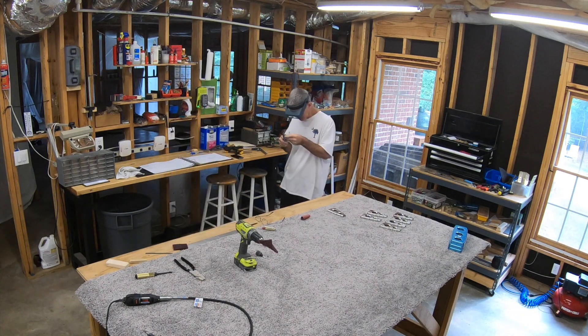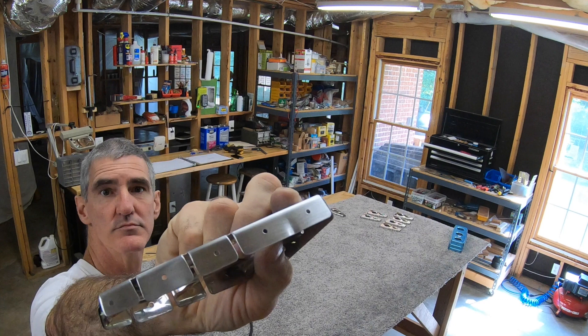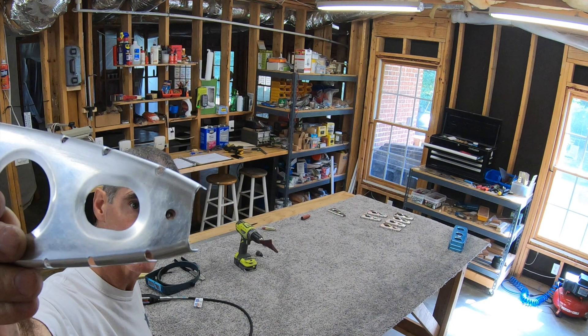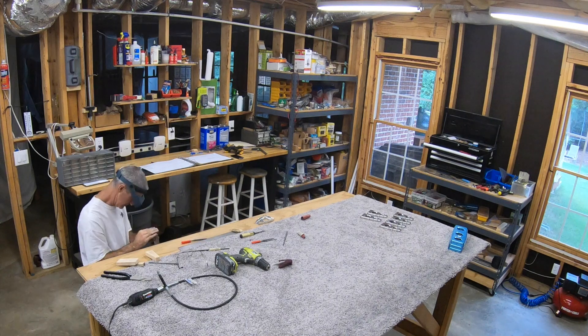I do spend a lot of time on that, and there are the results - you can kind of see it. You can see the flute that I put in that part of the flange. Then I go to work with my calibrated block of wood to bend the rear flange on two of the ribs to 99 degrees from 90, so really 81 degrees I guess.